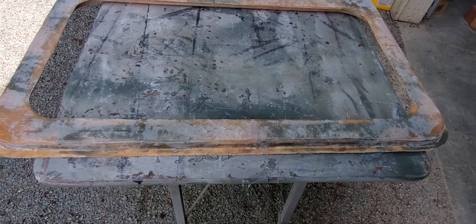There were a few cracks here and there, and you can see where I used what they call kitty hair — it's basically resin and fiberglass fiber mixed together. I repaired the cracks with that, and then I took a layer of glass mat and put it over top. It's pretty sturdy now — a little heavier than it used to be, but it'll last a lot longer.